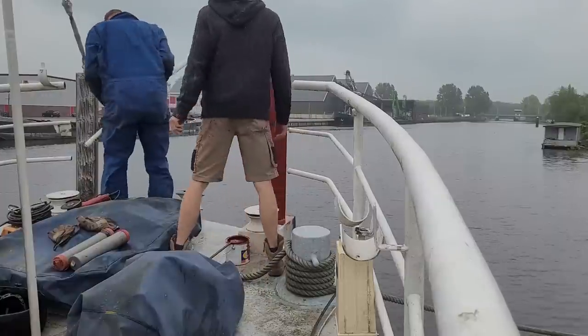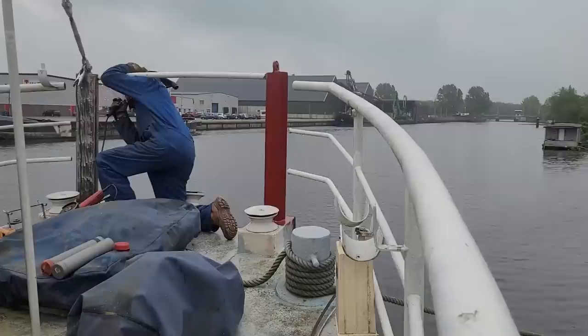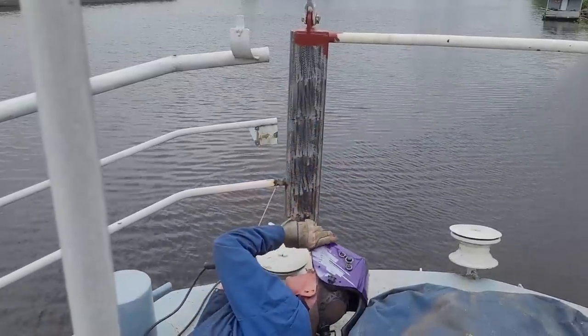That's two nice and very strong railing posts. They have to be so strong because they have a lot of purposes. Firstly, the mainsail boom traveler, which allows the mainsail boom to travel freely from starboard side to port side. On some ships, this is located on the main deck. But we have decided to raise it up a little bit higher to save space on deck and to avoid tripping hazard. Next up is welding the railing to the railing posts and applying some primer.